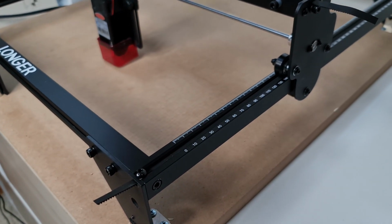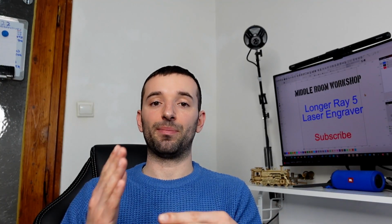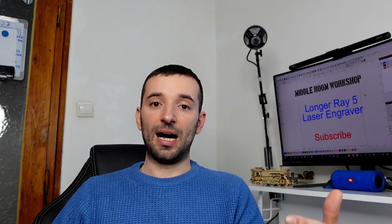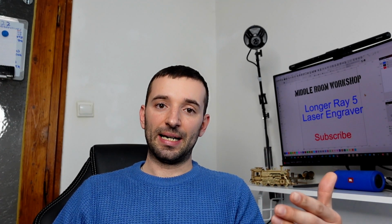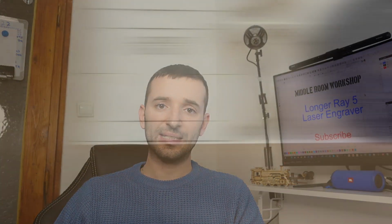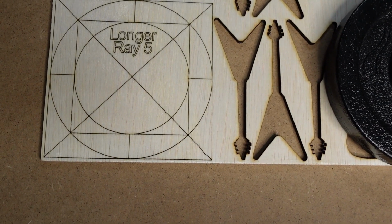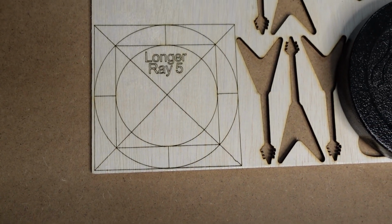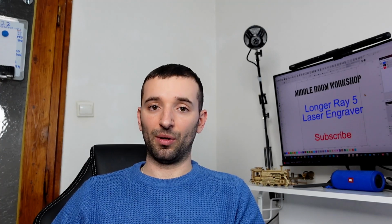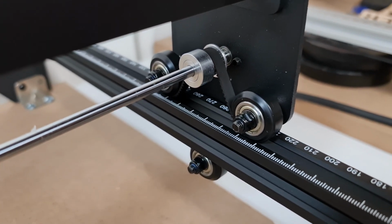squaring the machine, that means making sure that the axes are perfectly perpendicular and you get square angles, is a little bit trickier, because you will need to run a squaring test. That's something you can do with a simple square with two diagonals, then measure the diagonals, and adjust the timing belt on one of the two sides a couple of times.